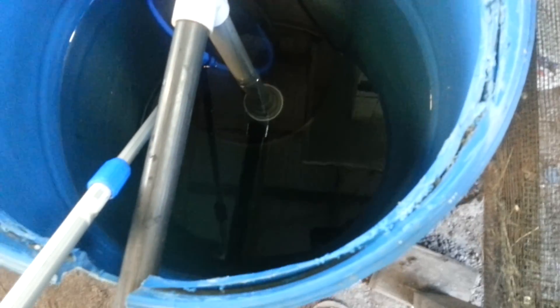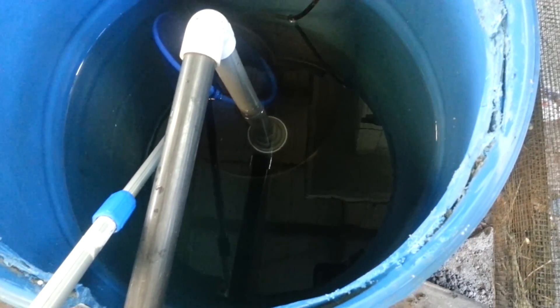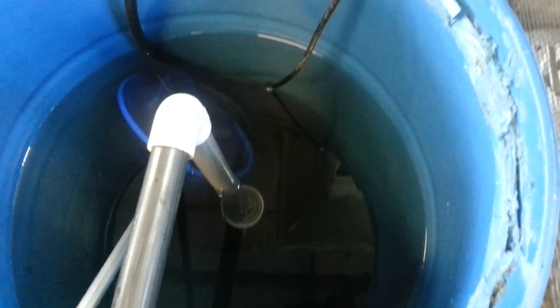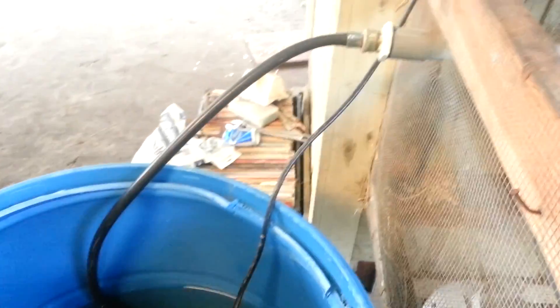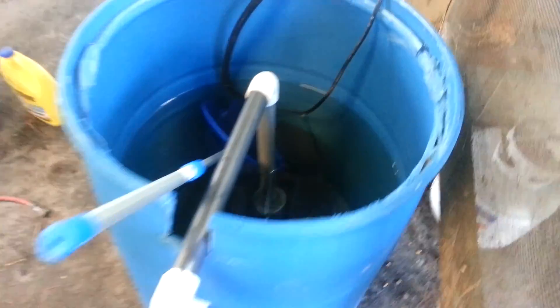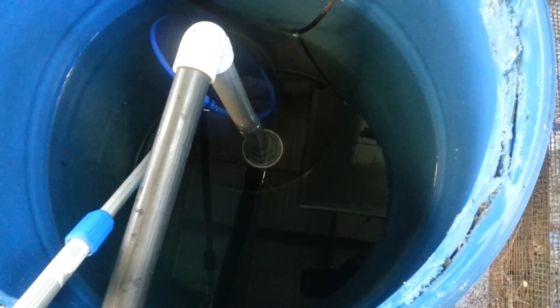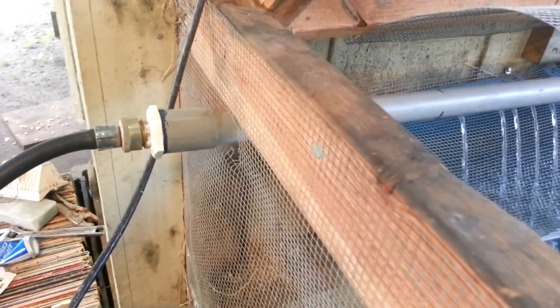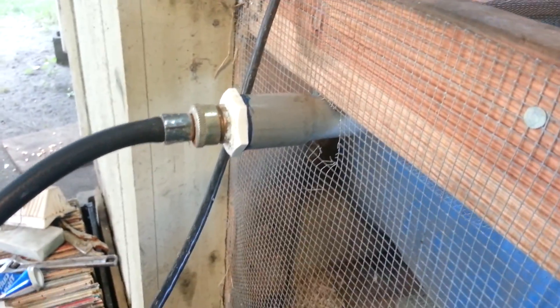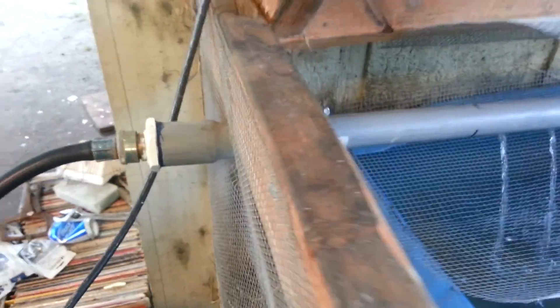This here is my filter — that's a five-gallon bucket. I've got a submersible pump in there that's got a water hose fitting on it that comes out the top. I put it in that five-gallon bucket, cut a little hole for my electrical cord, and that's a washing machine hose coming out. I've got it down in this 55-gallon drum for my water level so I don't have to keep coming out here and filling it up. It's just connected to a piece of one-inch pipe with a three-quarter inch to water hose connector that fits into a piece of one-inch conduit pipe.